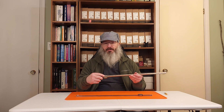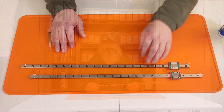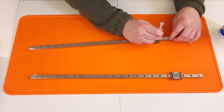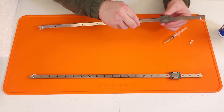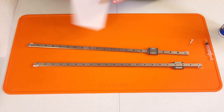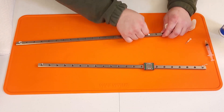The final task for today is to apply lubrication to the non-HiWin rails. Since these rails don't have lubrication ports, we're going to have to apply the grease through the back of the rails. This method is a little messier and requires a bit more cleanup since we're going to need to apply more grease than with the HiWin rails. First, remove the tip from the syringe, since the mounting holes in the linear rail are significantly larger than the HiWin lubrication port openings. Next, flip over one of the rails so a mounting hole under the carriage is exposed. Pressing the tip of the syringe firmly against the mounting hole, inject grease until you can see it coming out the sides. Move the carriage around a bit to spread the grease throughout the carriage. Apply a second amount of grease just in case some areas were missed. Repeat for all remaining non-HiWin rails. Now, using paper towels and cotton swabs, clean up all of the excess grease, sliding the carriages back and forth repeatedly to force as much grease out of the carriages as possible.